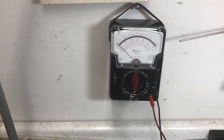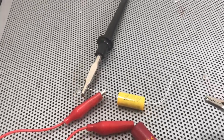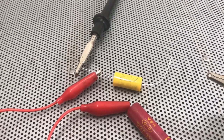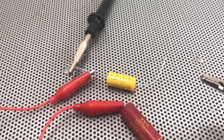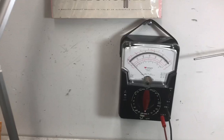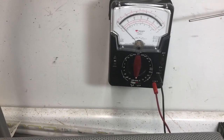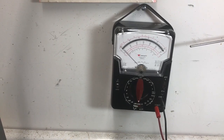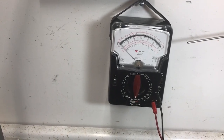What I wanted to do here is show you the difference with a brand new capacitor — these are polypropylene, and they're both .047s. The difference is these things are not leaky at all, hardly. Just to show you, it too is going to have a little bump and then nothing. Then I take the lead off, come back down and touch it — nothing. I'll wait for a little while, come back down, touch it — nothing.